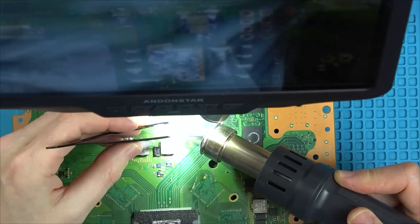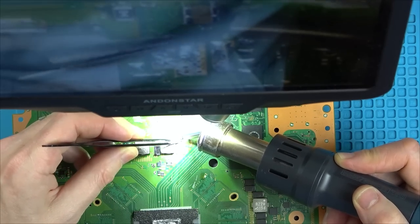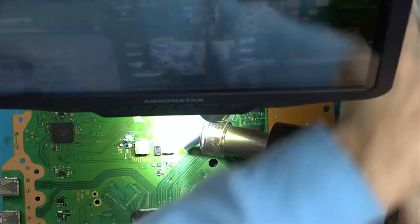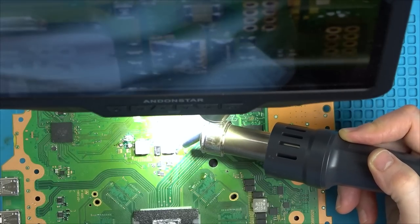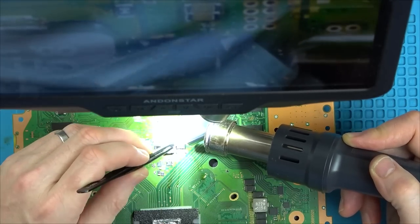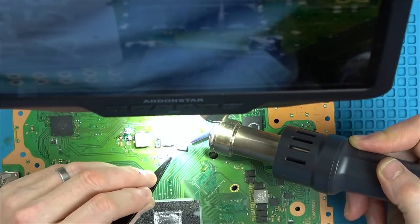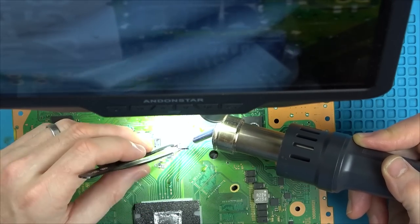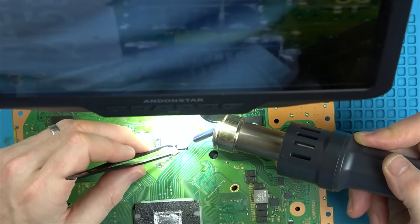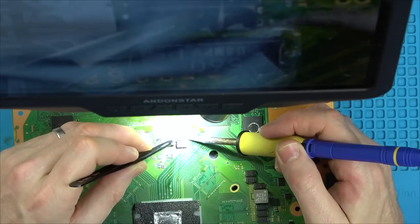We know that that MOSFET hasn't got any burn damage. And when I used my airflow up high and at 500 degrees Celsius, it came off really easy within about 30 or 40 seconds or something. That gave me the confidence to then take it off my working PlayStation 5. Contrary to belief, I'm not a complete idiot and I wouldn't want to damage my PlayStation 5 to try to fix a board which realistically is unfixable. Kind of eBay junk, but good for spares, I think we can definitely agree that.